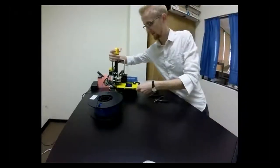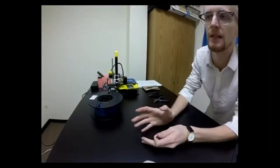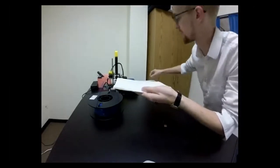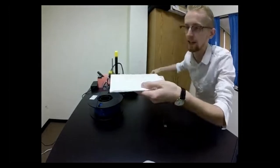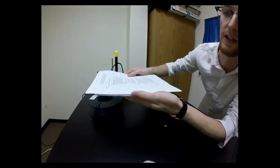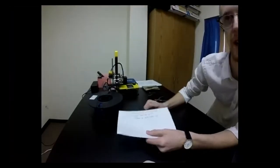The user asks what 'slice' actually means in layman's terms. Slicing means creating the layers the printer will go through — essentially telling the printer where it needs to go to create each layer. Saving as .gcode IS the slicing. The printer cannot find or use an .STL file directly — it has to be a .gcode file.